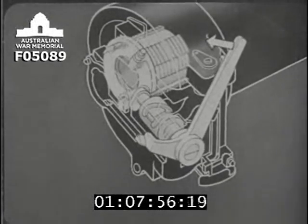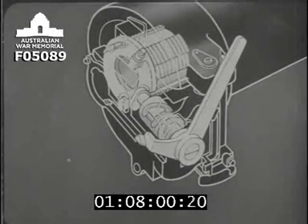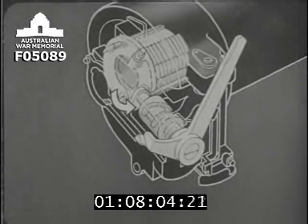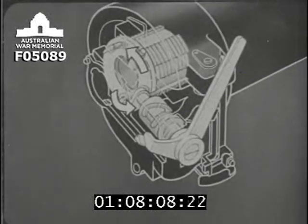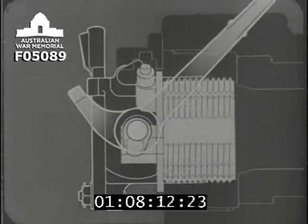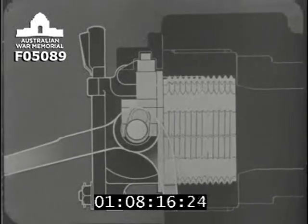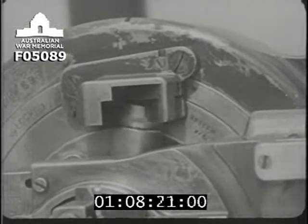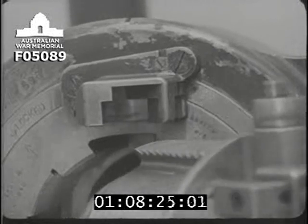To unlock the breech screw again, the LBM is moved back and down. This will move the crosshead round and upwards, which will rotate the breech screw anti-clockwise, unlocking it. Looking from the side again, let's watch the unlocking movement. As the breech screw reaches the unlocked position, the rotating cam and roller come into action again, and the breech swings open.